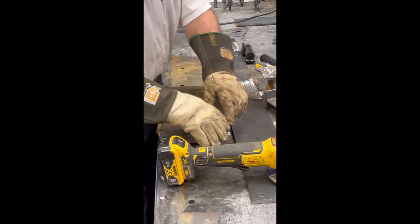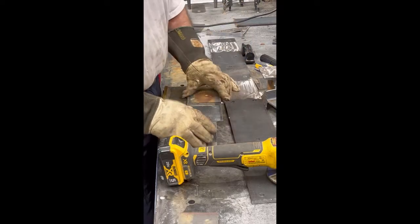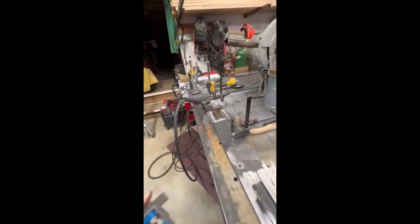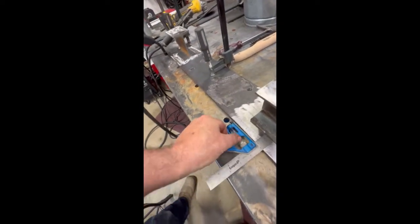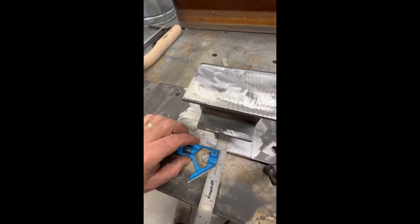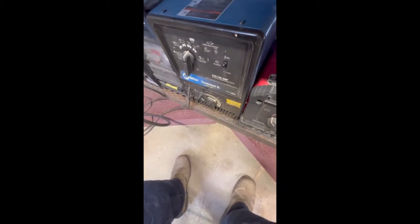I've got a magnetic plate — it comes in pretty handy for cleaning up these small parts like the gussets. It takes a lot of the clamping hassle out of the picture. We're about ready to strike up an arc on this. This is where my four-inch standoffs are going to be, and the critical measurement here is inch and three-sixteenths on each side. I'm going to tack it with the little 140.